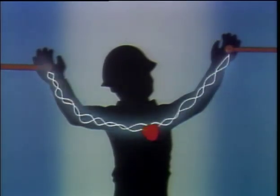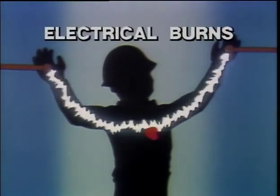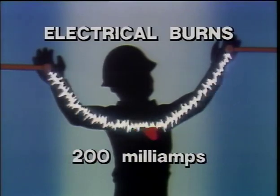This is where the individual heart cells lose their natural rhythm and the heart stops its pumping action. Fibrillation can result in death without swift medical attention. The most severe electrical burns result from current flow in excess of 200 milliamps. This is still only 1/5 of 1 amp. Regardless of where the contact is made on the body, this level of current flow can cause deep electrical burns, chest muscle contractions, and heart stoppage for the duration of the shock.